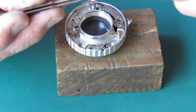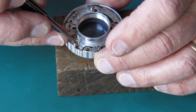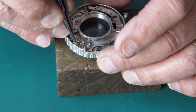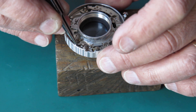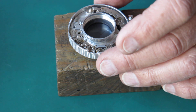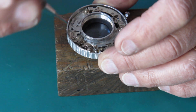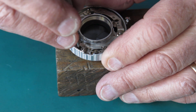You can start with our 500th of a second spring — that goes in there. That's the extra spring that gives the shutter the impetus to achieve something like a 500th of a second, as they claimed for it — which may not quite be true. Get that in place. Make sure that the toe of this is not sitting on top of that cam. There's one fixing screw.